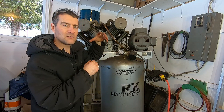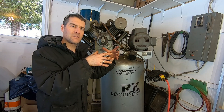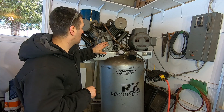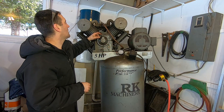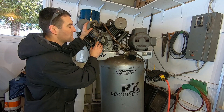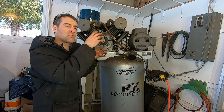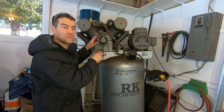When the air is compressed in the cylinders, it's possible that condensation comes out of the air during that compression phase, sits on the sides of the cylinders, and then slips past the rings into the crankcase. The more likely way moisture gets in is when this is running and gets hot — the air and oil expand and push air out of the breather. Without a breather it would crack the crankcase. So the breather maintains basically zero PSI inside the crankcase. But when it cools after shutdown on a humid day, it draws humid air back in and that condenses in the oil.